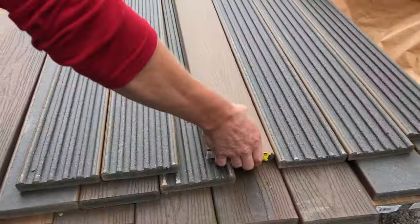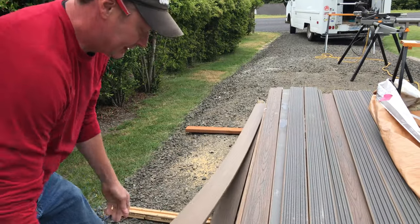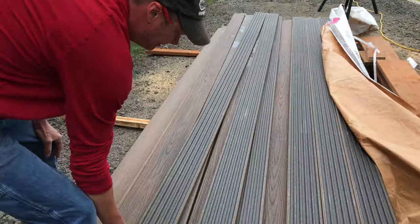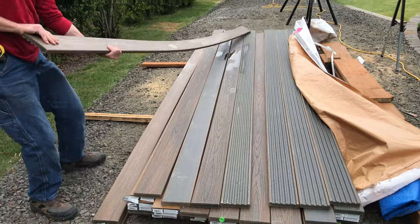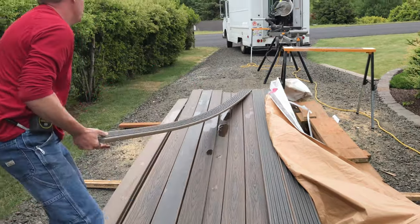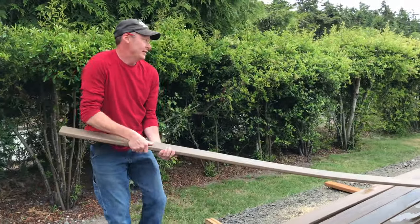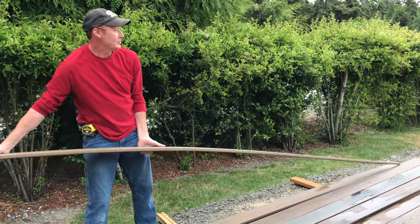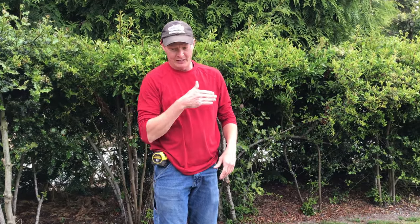The grooves on the back are the fascia — what I'm going to use for fascia boards. It's a little bit thinner, about almost a quarter of an inch, than the actual surface boards. This is the Trex Transcend style of composite decking boards. I'll be putting the picture frame together — the perimeter of the deck is where I'll start, so that I've established my layout.